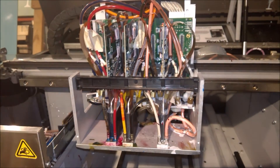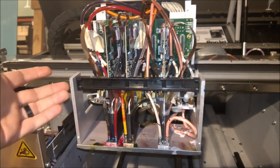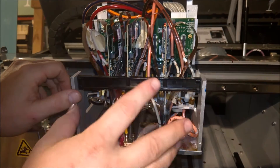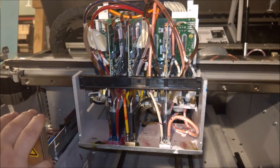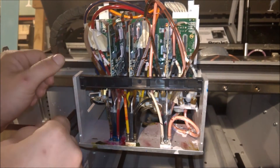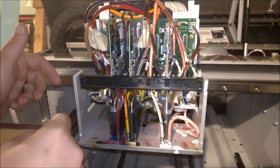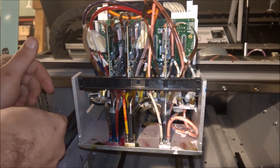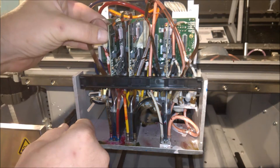I have released the carriage and we've turned the machine off, so we don't have to worry about anything. Definitely touch metal so you can ground yourself so you don't short out anything — that's very important. If you want, get one of those little grounding straps you attach to your wrist so you don't build up any static electricity.